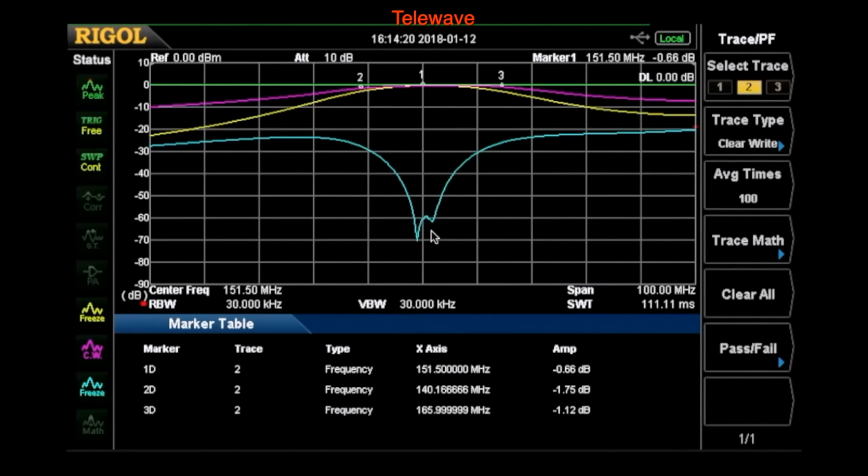Then, if I take the same situation where the power is coming through the unit from the outside, or the output side, this purple line here shows what the attenuation is going to the first dummy load on the output of the isolator. And as you see, it doesn't attenuate much. So all the energy all over this whole spectrum here, down to about 7 dB on this side and 10 on this side, will be going into the first dummy load that's on there.